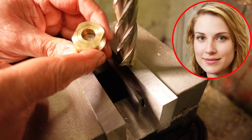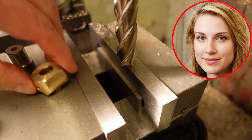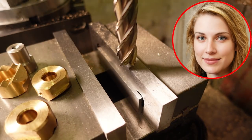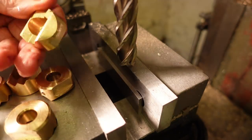Look at that horrible burr. That long series mill was a dreadful choice for this operation. You can't fool me, that's a three-quarter job and you were too lazy to swap to that lovely sharp 16mm carbide slot drill because you'd have to change collets. Good grief, man. Get a grip.